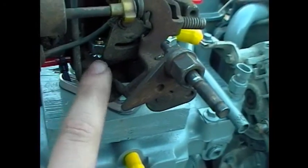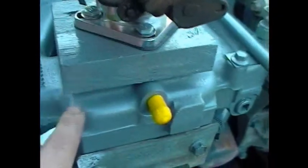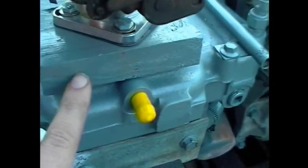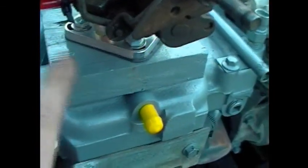And this came off of eBay, but I think they're pretty much all the same. So if you're doing a similar conversion, that is a Holley carburetor with a 2 to 1 barrel adapter using a 1x6 as a spacer. This could be done with an aluminum block or a brick of ABS plastic if you really, really want to. At this time, we don't have the alternator wired, but I will go over that later.